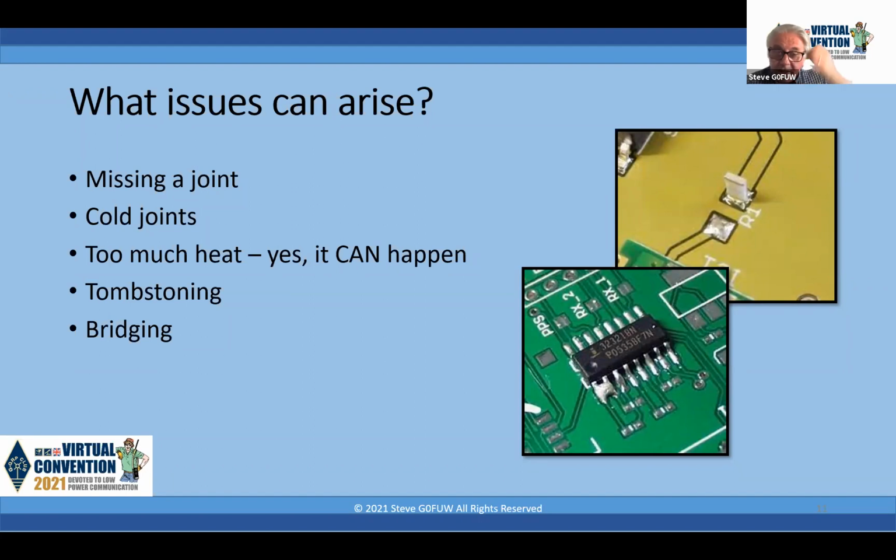But again, like conventional components, if you put too much heat on, you're going to destroy the components. I always quote this: the worst example I ever had was a guy who rested the soldering iron on top of a relay while he went to find his next components, and we just saw the soldering iron disappear into the body of the relay. And yeah, that involves some considerable reworking for sure. That can happen with hot air just the same.